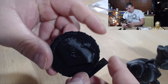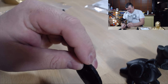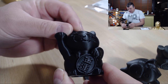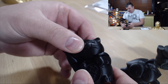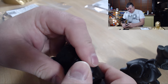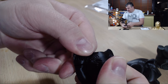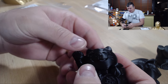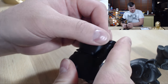The layer adhesion is not as good as the Alga Filament. In this model I printed at 180 degrees, and just for fun I tried to find out if I could break the head of the cat. I could. So at this temperature, maybe layer adhesion is not very good — I can easily break the model apart. This filament might need more temperature than the lowest recommended temperature of 180 degrees.